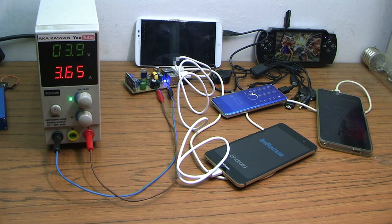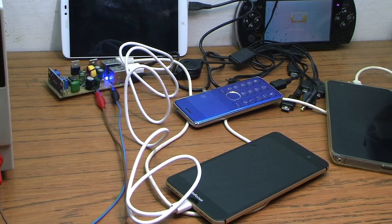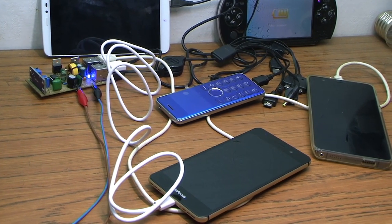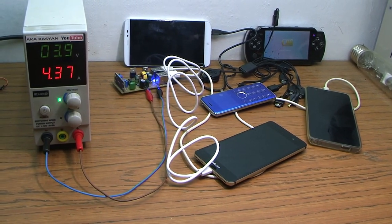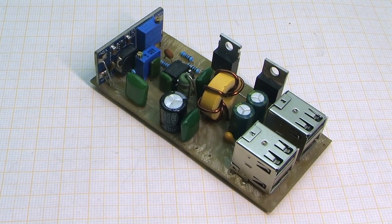Pay attention, power transistor and diode rectifier without a radiator. And I must say that the temperature on them in 5 minutes of operation in this mode didn't rise above 55 degrees Celsius. The output voltage of about 5 volts almost doesn't drop. But friends, this all is not significant. We will make real measurements in the next video.